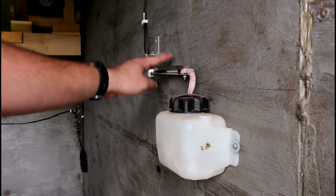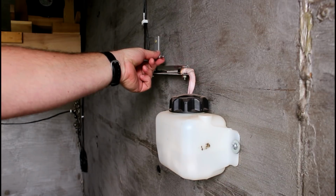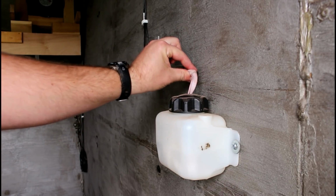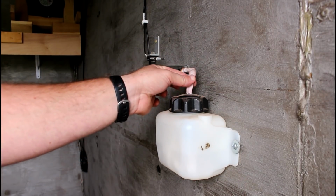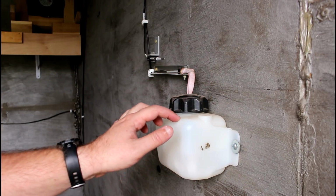And there's two probes right here on this wall. It's two different instruments. This is the dry bulb sensor, which tells you the temperature of the kiln at all times. And this is the wet bulb sensor, which tells you the humidity inside the kiln at all times. There's a small little wick right here that goes over this. It goes down in this reservoir.